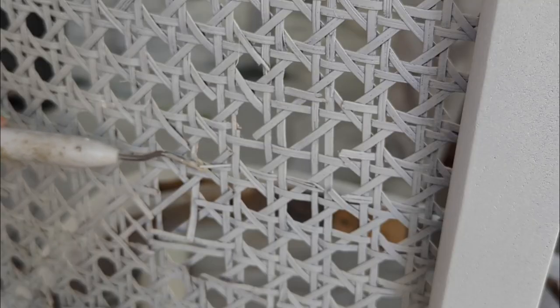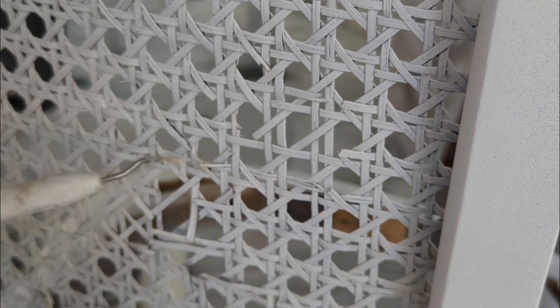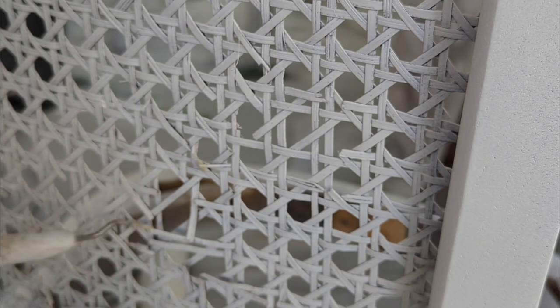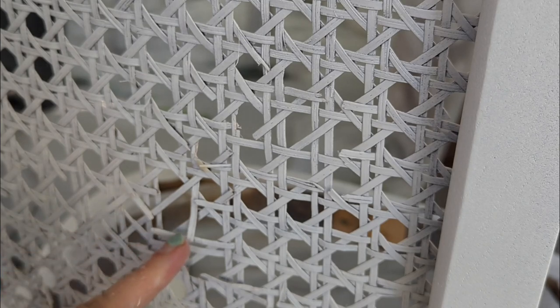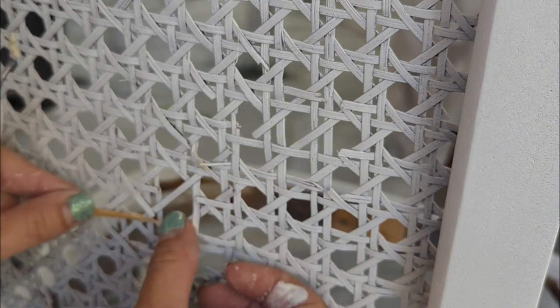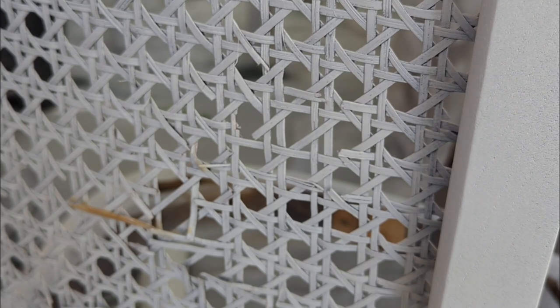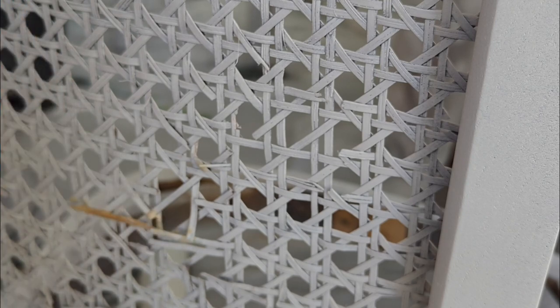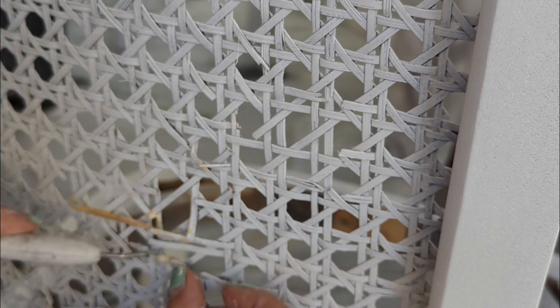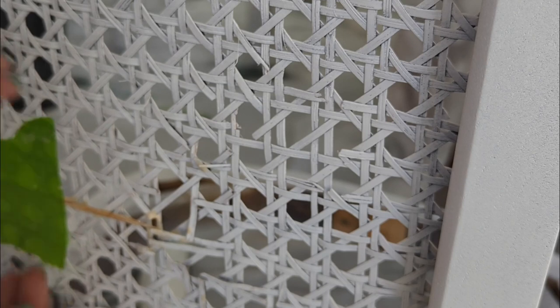I'll let you enjoy this process — it was in real time, so realize the amount of time I spent on these chairs. I am using a Cricut tool right there with wood glue on it trying to push in and get the wood glue to stick right away, but wood glue needs something to hold it for a little bit. I ended up using some green frog tape because it's not going to fully stick to the wood, but it holds it down in place so the wood glue can dry. For spots where the caning was missing completely, I shredded toothpicks into two so they were a bit flatter like the caning, and I threaded them through as braces to create the caning look.